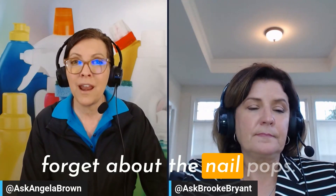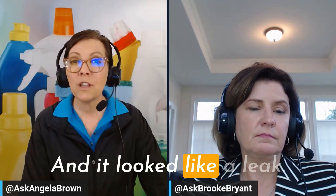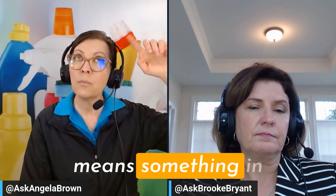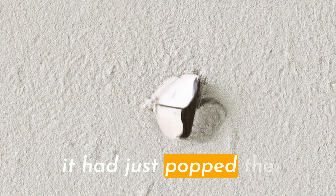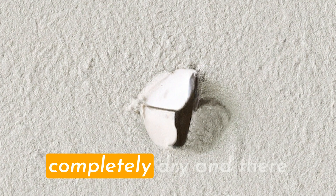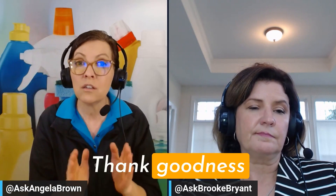When we're talking about fixing the cracks in the walls, also don't forget about the nail pops. I was sitting there the other night with my husband watching TV and I said, 'What is that in the ceiling?' It looked like a leak from up above, which would mean something in my roof was leaking. He said it looked horrible — like the whole ceiling had just kind of caved in a little bit. But as I got up close, it was just a nail pop coming through; it had popped the drywall off. It was completely dry with no staining around it, but it was really unsightly, and then plaster dropped off leaving a little hole that has to be re-spackled.